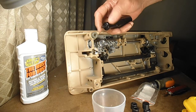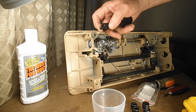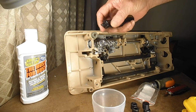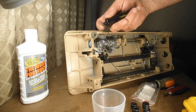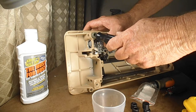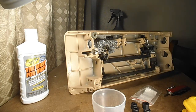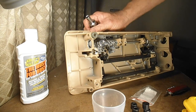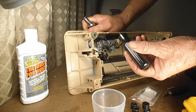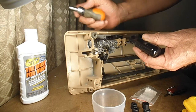In the previous videos I've talked about doing WD-40 before removing screws. But I want to make it clear that WD-40, in my opinion, is not a penetrating oil. I use that to soften up that hardened, varnished oil so that I can get the screws out. I don't feel it works that well on rusty screws, and rather than use a penetrating oil, I use more of a kind of impact wrench system. Now I have a little 2-ounce brass jeweler's hammer, but I can't find it today, so I'm just going to use this little ratchet screwdriver as my hammer.